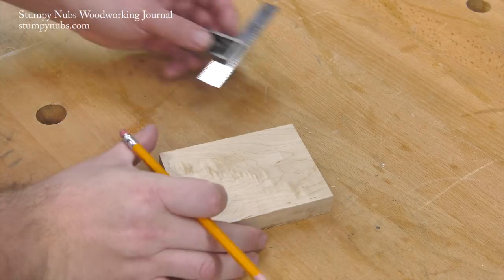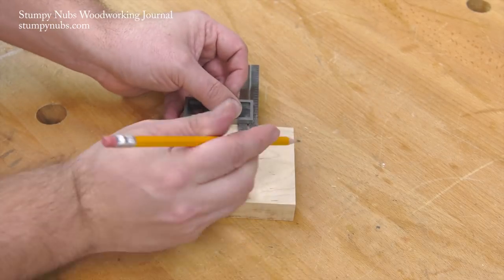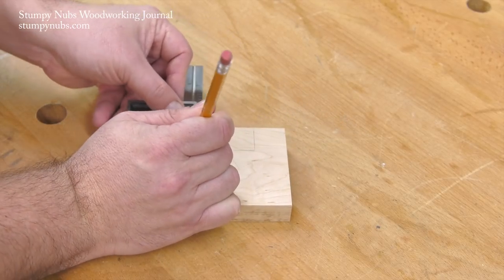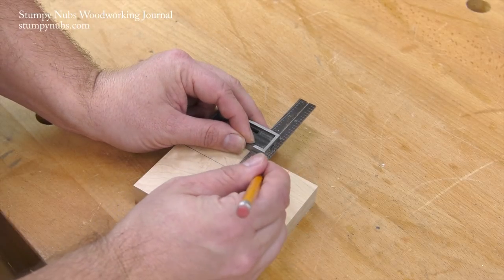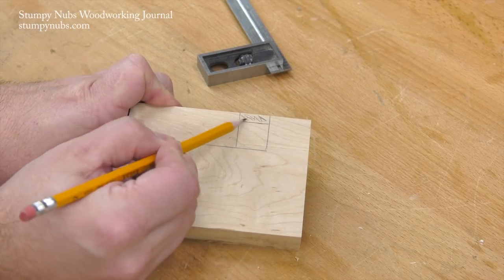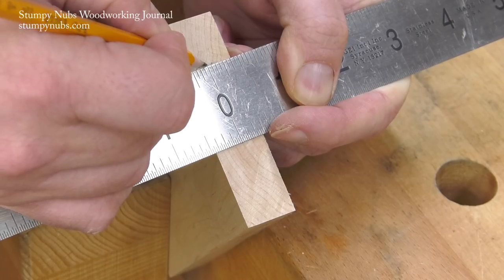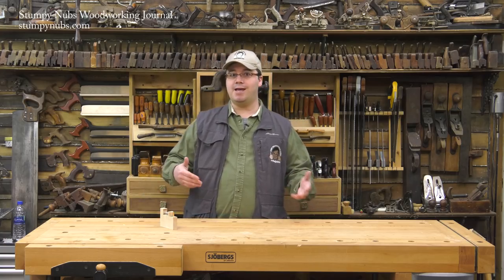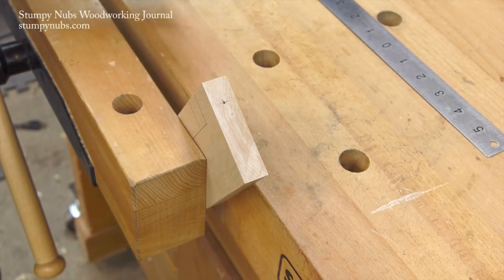I began with a four and a half inch by three and a quarter inch piece of three quarter inch hardwood. I drew a one inch long line one inch from the end, then another line perpendicular to that one one inch from the long edge. I laid out a third line three quarters of an inch from the first line, then a final line connecting the two one quarter inch from the top edge. On the end I marked a point three quarters of an inch from the top edge and centered it on the end grain. Since it's end grain, it's helpful to use an awl to create a dimple so the bit won't wander as you start drilling.